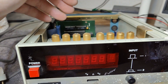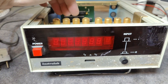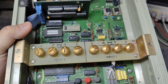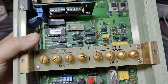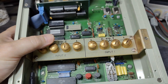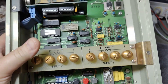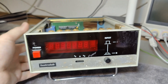About the RTDs — the most normal of RTDs will be 100 ohms. But if you look at the picture I found online on one of the eBay ads, I found all backside information about this similar unit. And it explains I think it was 25 ohms for an RTD. So that means we've got definitely special or different RTDs available. So I don't know exactly what this one is yet, but I prepare to find out if there is any kind of life in this unit.